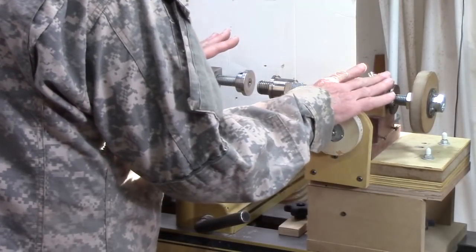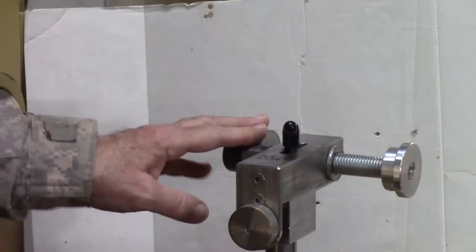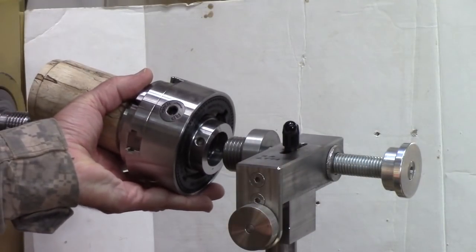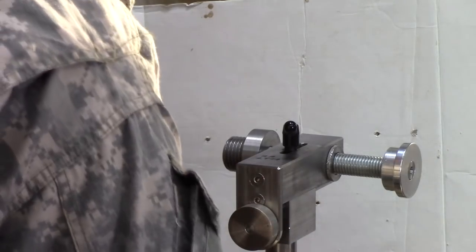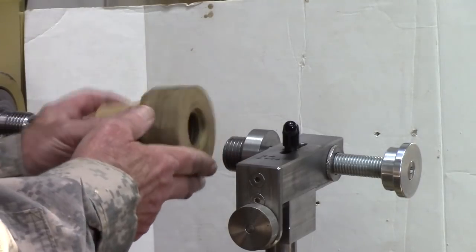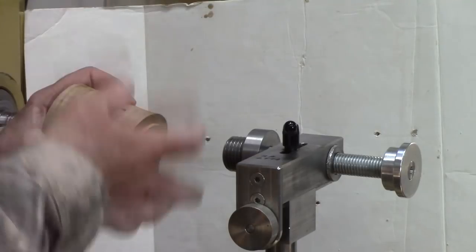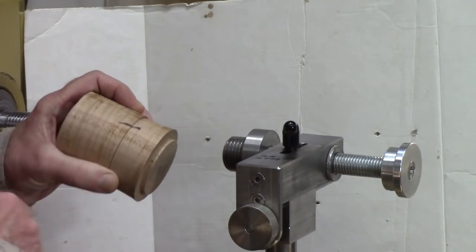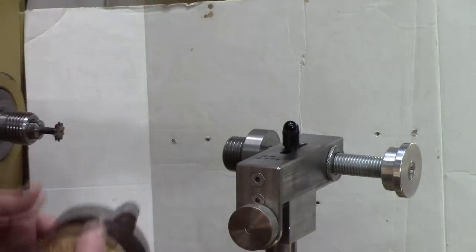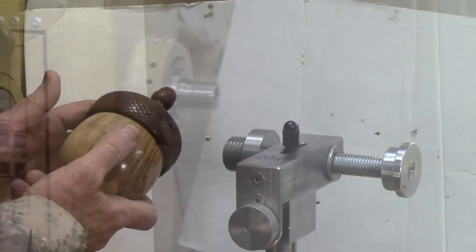You need to make sure there's no slop in your lead screw. One of the last things they have in common is a nose piece appropriate to the chuck you're going to be using. Chucks are kind of heavy — what I prefer whenever I can is a threaded glue block. I'll have a link to a video on how I tap these glue blocks, but this is the ideal way because you can take them on and off and always get perfect registration. Also, when you part the wood into two pieces, go ahead and make a witness mark for grain orientation to make it easier to match the threads.